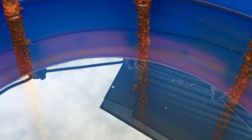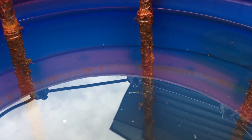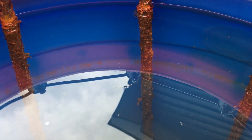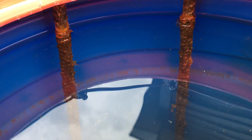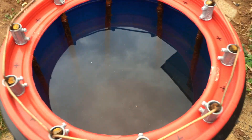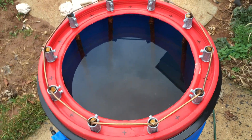The connectors hold the rebar so it's suspended in the fluid. You can also see the scaly rust on the rebar — that's a good indicator that you're actually getting rust off the object you're trying to de-rust, because these rebars are sacrificial anodes. I wanted them to work around the entire perimeter so the electrolysis would work on all faces of the object. The 10 rebars in a circular pattern create an environment where electrolysis works in a 360-degree circle around the piece.